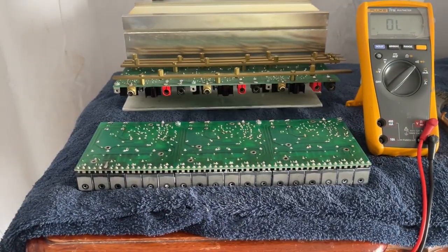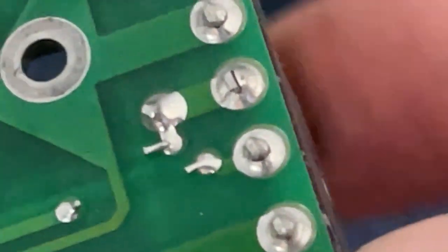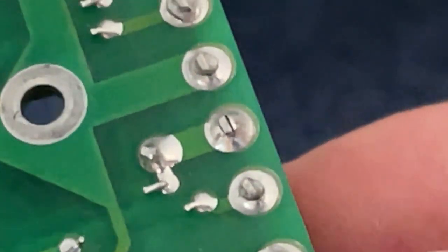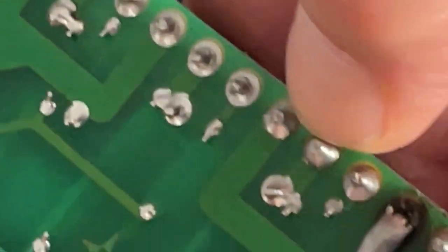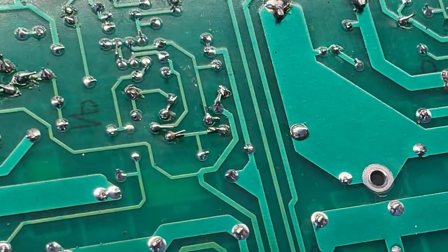Note that short over here — somebody had to repair that. Somebody built a bridge. There's a bunch of cracked solder joints, and you know that can cause arcing and voltage spikes and cause damage. But I couldn't find any dead shorts, so apparently the board had been repaired. I can see it right here — somebody had fixed that. These solder joints in the area are okay, but then as you get down the board you find a bunch of bad connections. I gotta resolder the entire board.